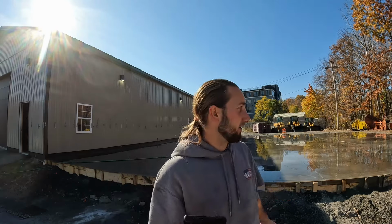It's kind of hard to tell how much water you're putting on here, especially when it's evaporating, it's sitting soaked in, and it's running off the sides. So I really have no clue how much water I did put on there. Don't overwater it. Too much water can cause the concrete to crack. I don't think we're gonna have that issue, being that I can only come here really once a day. Maybe I can come in the afternoon some days as well. If it's expected to rain before the first 2 to 4 hours, cover the concrete. We don't have to worry about that. Don't water in cold weather. Spraying concrete with water is not recommended in cold weather. So that's pretty much what it says.